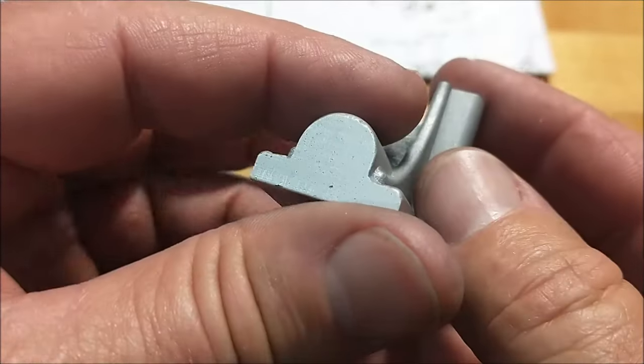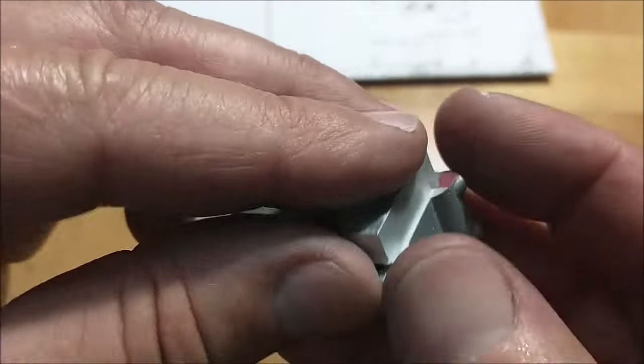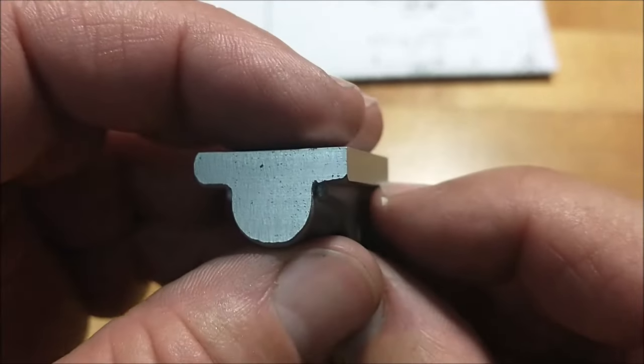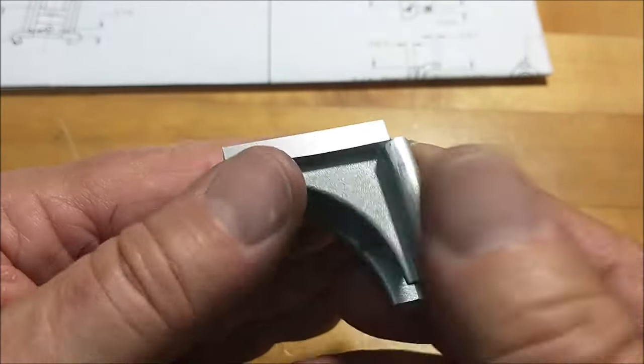So far, so good. Well, the machine surfaces, I'm going to try not to blast these machine surfaces until I absolutely have to. I just trust it more. And yes, there is a step right here, but I made sure that the step was wider than the thickness of the parallel I intend to sit this down on.